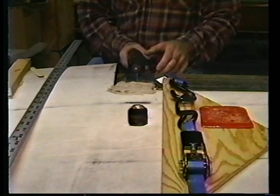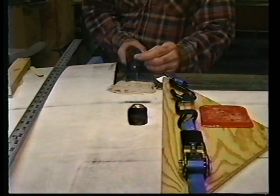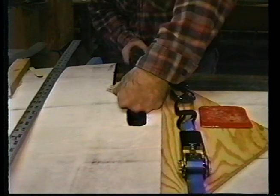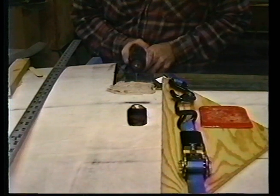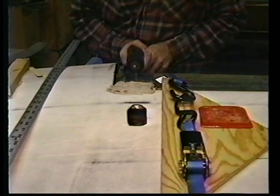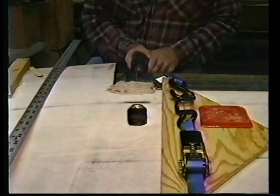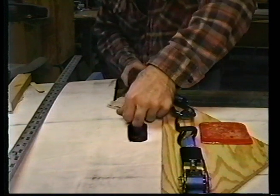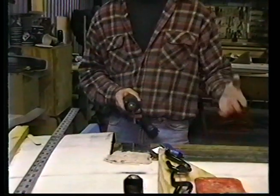At this stage, I'm not doing much to maintain level. The reason I'm not doing that is because I've got about 3/4 of an inch of material, carbon, glass, aluminum, that's acting as a drill guide, and I should come out very close to the middle of this block when I come through. The first block I'm going to go through is 1/8 inch thick, which is on the outside of the ring. In the middle of the block? It's center. There it is. That's where your bolt head goes. And I'm going to take all of these out to 3/16. And then I'm going to take them all out to 1/4 inch.